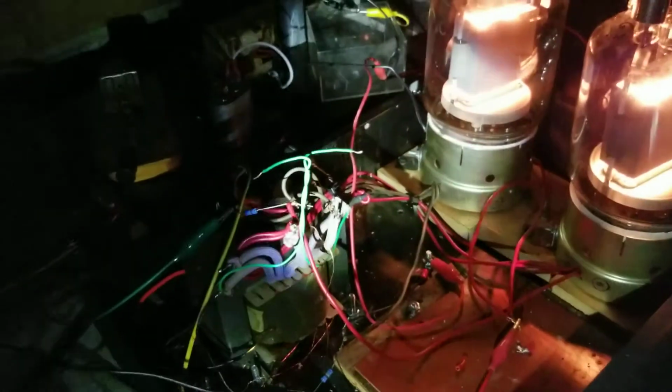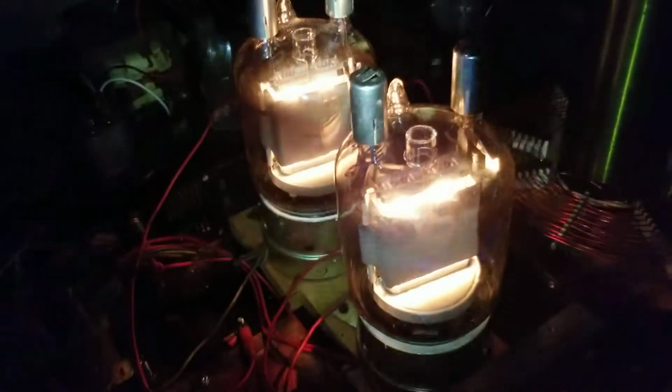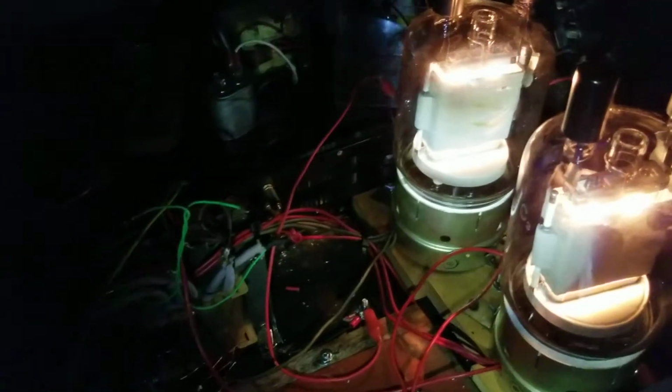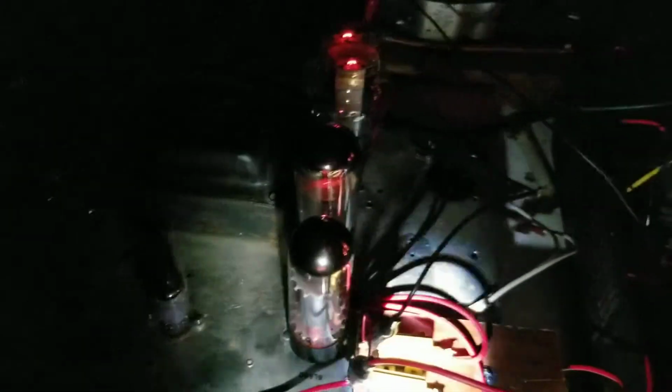I've got these two 8K 25 watt screen resistors. It just spit up by itself. Anyway, those are on the screens of the EL34, and 5 microfarad. Well, it's a DC coupling cap, but it's really not. It's part of the mag amp. But then over here I've got two 47Ks, I think, or 100Ks, I can't remember what they were, just to restrict the current to the control grid on the pentode. The screens on these pentodes are running at about, I think, 450 volts, which was the B plus voltage over here, so I'm just tapped into it.